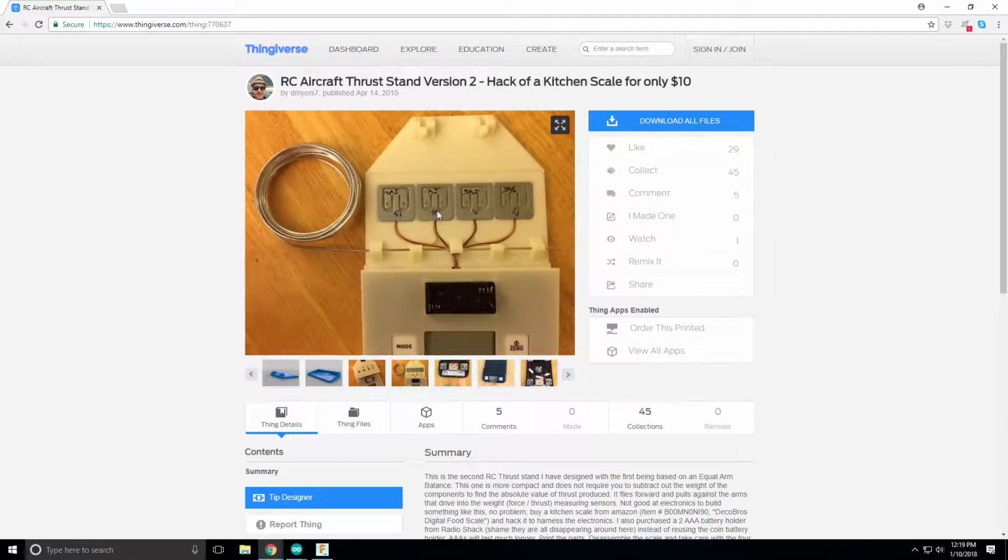These right here are load cells. Pretty much all of these are going to use load cells, and every scale uses a load cell. What a load cell does is it has something called a strain gauge, which is some wires that go through this part here. I believe they're resistive in measurement. So when the metal flexes, you'll have an increase in resistance, and you'll have a Wheatstone bridge, which is an arrangement of 4 resistors in a square with, I think, 1 or 2 going across the middle. So it's kind of like a square with 2 cross hatches through it with resistors.